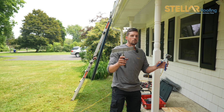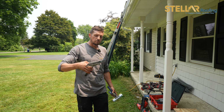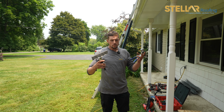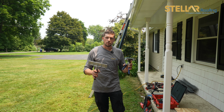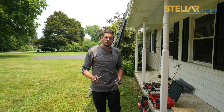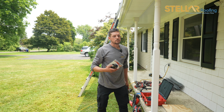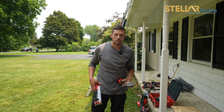These are great for standing seam. You go to the end of the roof that bends around the drip edge, you get this on there, you squeeze down. It helps keep that nice and tight and keep its form so that over time, nothing can get under there and push the metal out. It's very important that at the end of every job, you secure your standing seam. You lock everything in tighter. So we have an assortment of these on every job. Every guy has them.